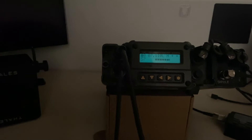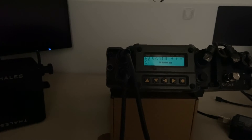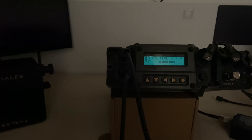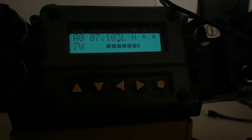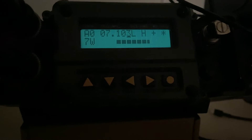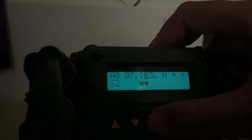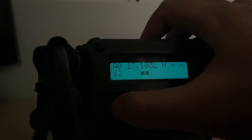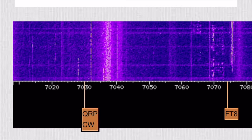What I can see is that I get very loud power from this radio once the tuner is connected. I will do some tests without the tuner. At 12 volts it should be giving about 10 watts, so it's okay. This is my signal received by an SDR in Andorra, about 300 or 400 kilometers away.